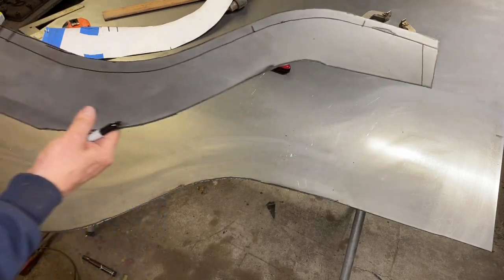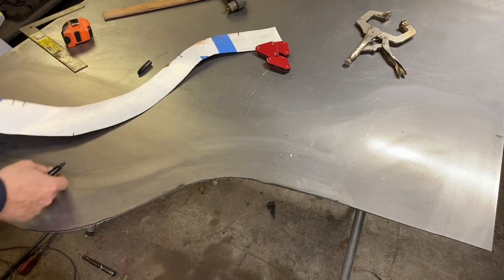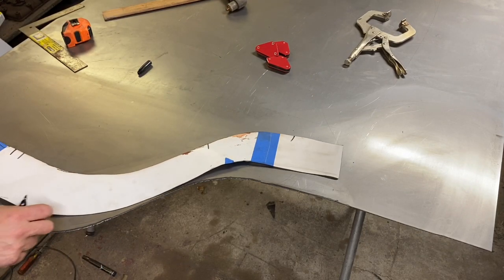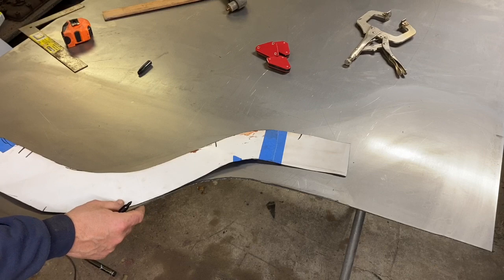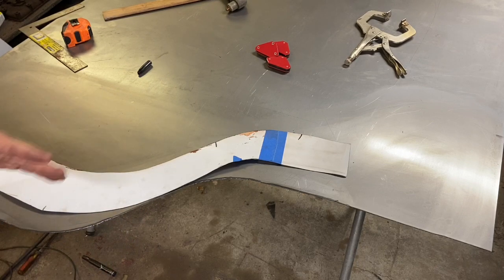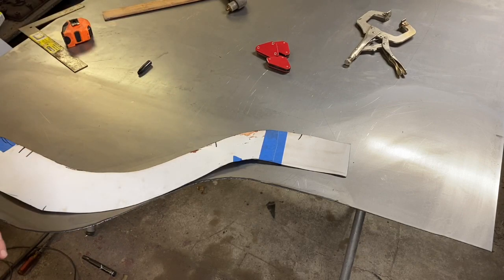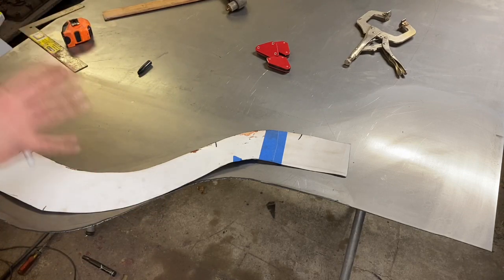And of course, this may be something that y'all know, but I want to make sure that I emphasize: when you cut a piece out, don't use the piece you cut out to make the next piece. Use your template. Always use your template. I can't emphasize that enough, the importance of that, because what happens is if you don't, and you make two pieces, one piece is going to change a little bit because of the template, then the next one's going to change more because you used the piece you cut out, and by the time you do 2, 3, or 4, the fourth one is going to be so much different than the template it won't even look like the same part. I'm exaggerating, but not much. So always go back and use your template as your master for laying things out.